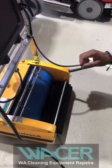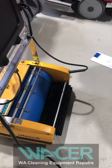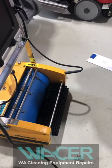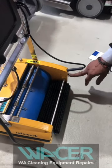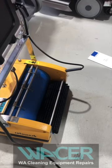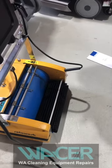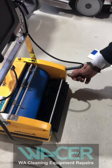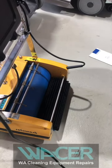Also very important: on the Rotowash you've got a reset button. If you're cleaning a facility and a tea towel or other obstruction jams on the brush, the machine will go into protection and your reset will click out. Unplug the machine from the wall, return the handle to position, and remove the object that caused the trip. Then take a key or a pen and press the button on the inside — there's a black button that pops up, press it in and you'll hear the click.